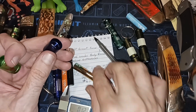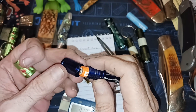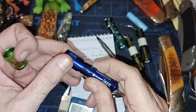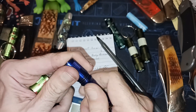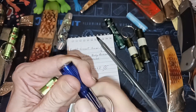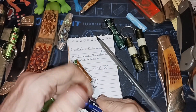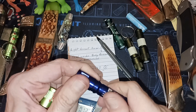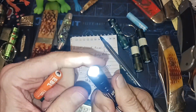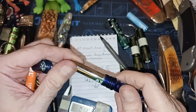If it's cut, it doesn't have to go very far to touch the battery. The head doesn't have to go very far down to touch the positive post, but it has to screw down pretty far to touch the negative threads. That would explain if it didn't work at all — with any battery. But it'll work with an alkaline. I suggest Olight check their entire batch of the i3e with a 1.2 volt — check them all. You're going to find a lot of them do not work with 1.2. They only work with alkaline because they're probably just being checked with alkaline.